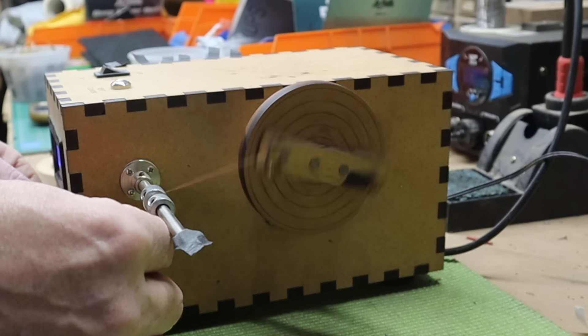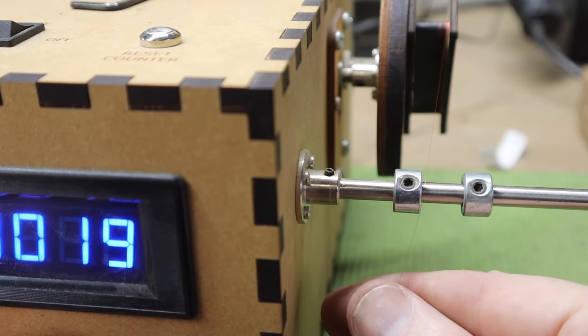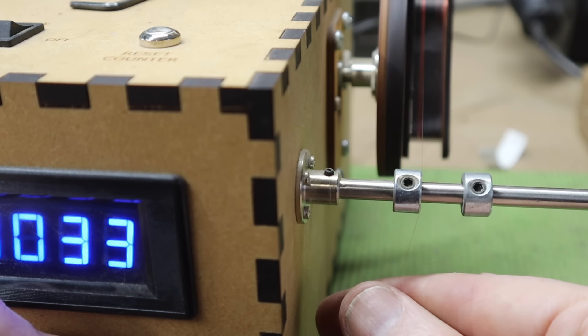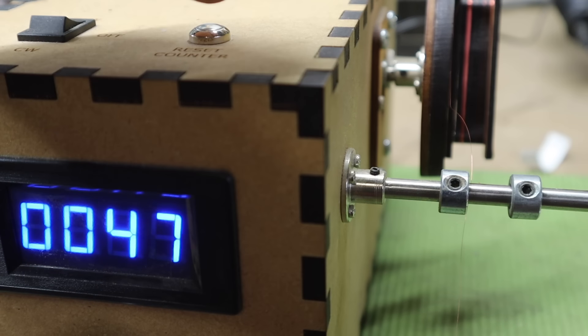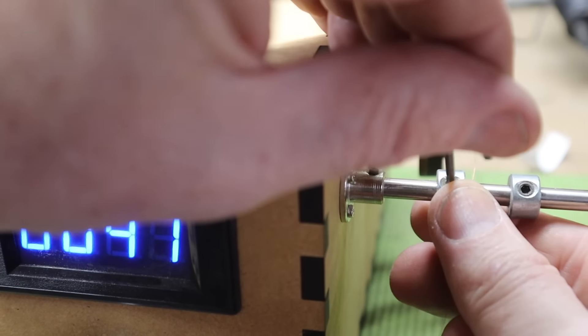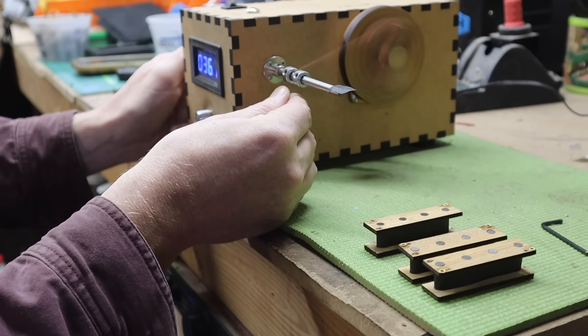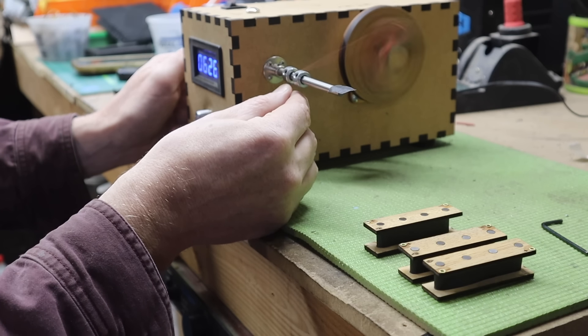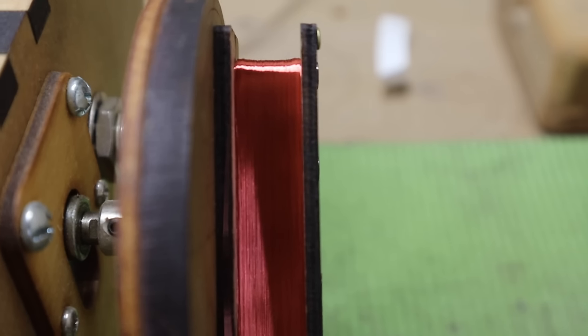I use the machine rather than winding by hand, starting very slowly to get a couple of wraps around to make sure the wire is tight. Then I set the width I wind back and forth on the bobbin using the little stoppers — I go all the way to the left, wind a little, and adjust to go just a bit further. You want to be careful to go all the way to the end of the bobbin but not so far that you get loops slipping off. Then it's really just sitting down and scatter winding — moving my right hand back and forth side to side to keep the winds even. I check every thousand winds or so to see if one side is thicker than the other.